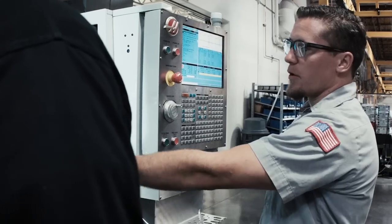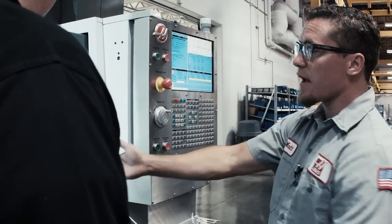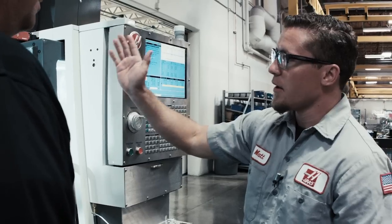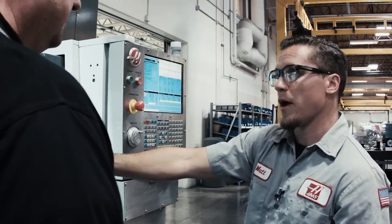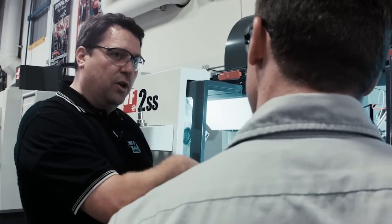You're going to see a six-hole bolt pattern. The first set, we're going to be using high-speed steel, peck drilling, using traditional flood coolant. The second set, we're going to be using through spindle coolant with a carbide drill, and I'm just drilling in one shot. So the big difference we're going to see is through spindle coolant, and that's going to allow us to punch the hole in a single shot rather than peck drilling with that high-speed steel drill.